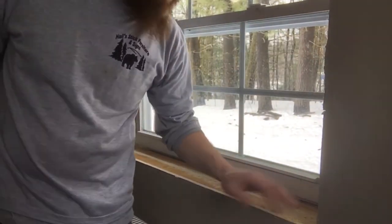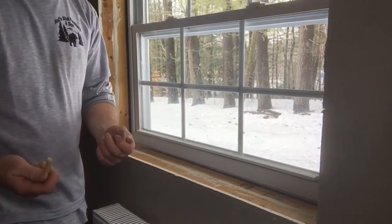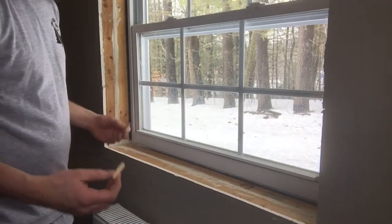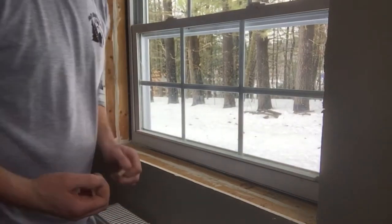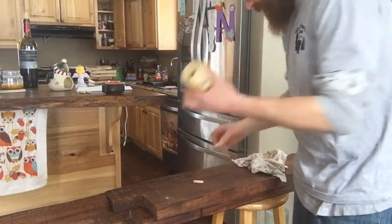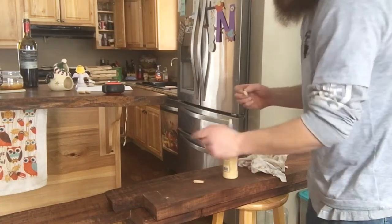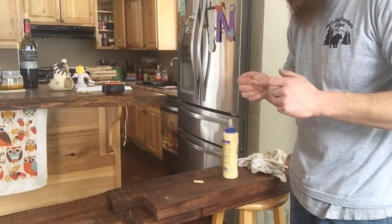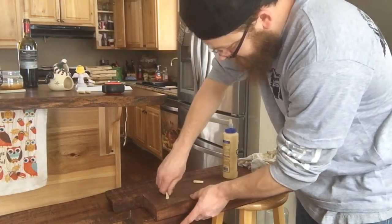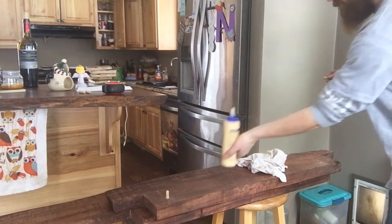Luckily there are no nails in there — that could have made for an interesting situation. I'm not planning to glue these into the sill; I'm going to glue the pegs into the countertop only, so if it ever needs to be replaced or have more work done it should just pop right out no problem. Got my pegs and my glue. I found that putting glue on the peg is much better than putting glue in the hole — glue in the hole always ends up being too much and the peg never sits down properly.